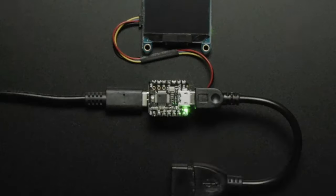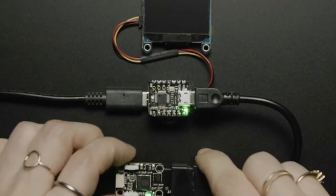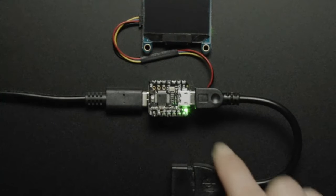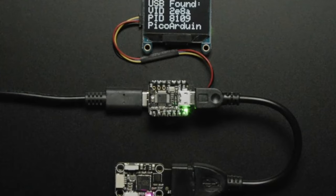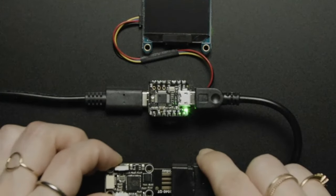To connect it — it is a Micro USB rather than USB Type-A because Type-A wouldn't fit, so you use an On-The-Go cable, which are only a couple bucks and you probably have some since they're used on the Pi Zero. That converts it to USB Type-A. You can also turn power on and off to hard-reset your USB devices by bridging that jumper on the back. This is supported by USB on RP2040, SAMD21, and pretty much any modern microcontroller chip that has enough space — so not a 32U4, but most modern chips can use the MAX3421E, especially with USB library support.